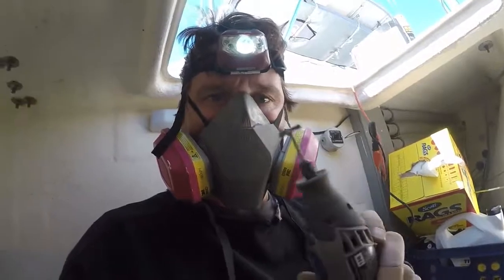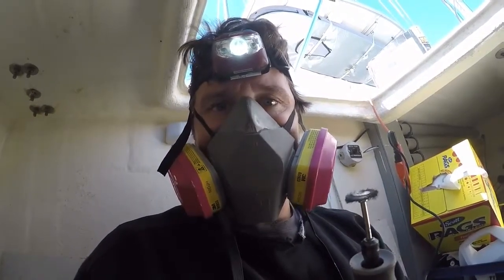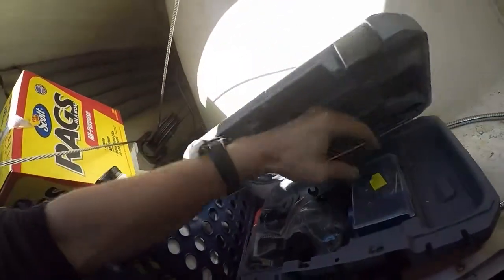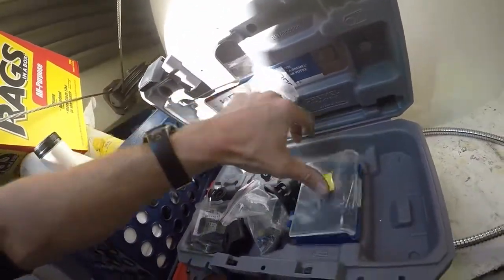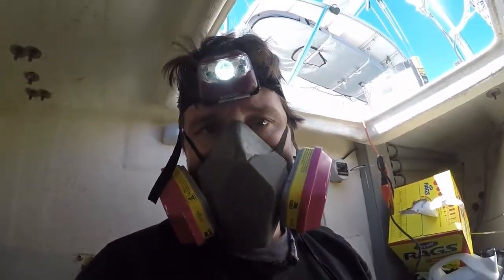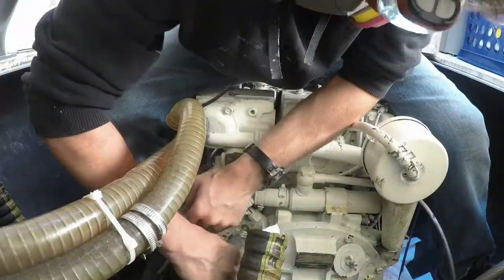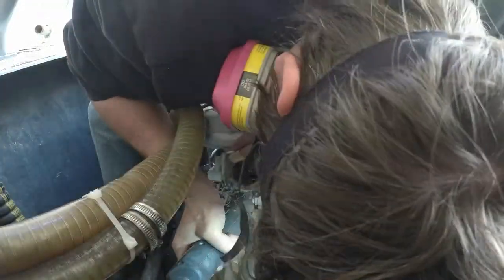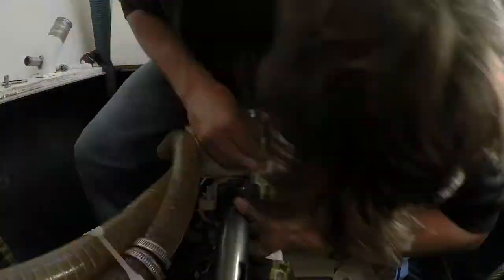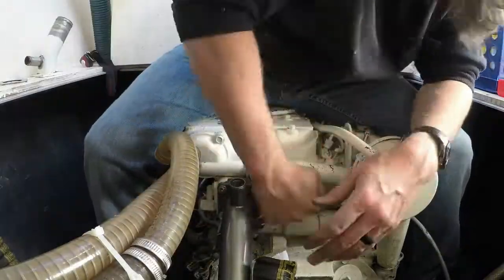For the last bit I use a tiny micro wire brush on the dremel — you really can't live without a dremel on a boat. There's tons of different attachments: cutters, polishers, sanders — you will need all of it at some point. The micro wire brush on the dremel is the best tool to get into all those tight spots, like cleaning the corrosion underneath the mixing elbow where it leaked onto the tach sender. This is the final assembly of the mixing elbow being put in — you can see how clean it is. It goes right in with a nice flush fit.